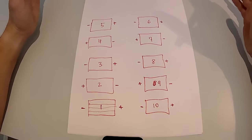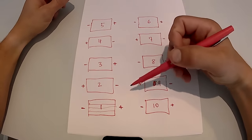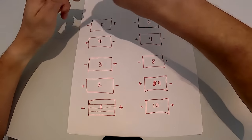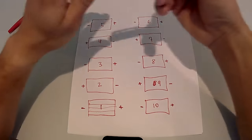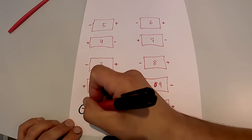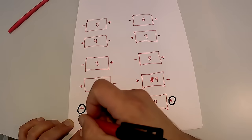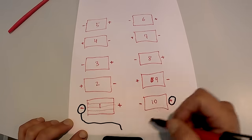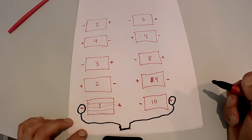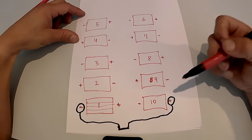So next, let's draw a diagram of how you're going to connect all this in series. The diagram will be representing the nickel strip that we'll be using to solder all these cells together. I'm going to use this black Sharpie to illustrate the nickel strip, negative node. So this is going to be your whole negative for the entire battery, and this is going to be positive for your entire battery. You're going to have 2 cables coming out of your battery that will connect to your ESC. Between those two connections, you have to connect all this in series to create 42 volts.